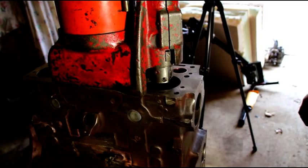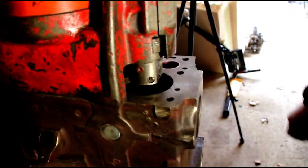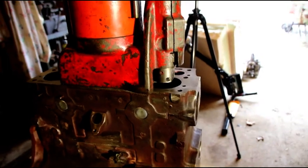The next thing we've got to do is get our tool set for the bore size that we want, then we'll slip it in the slot and begin boring. I'll show you the micrometer and how we set our tool bit.